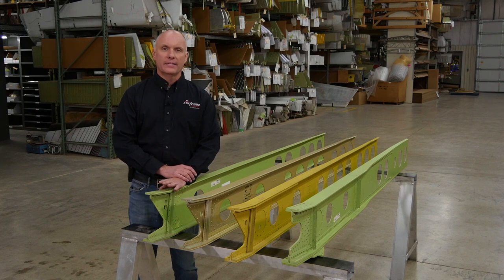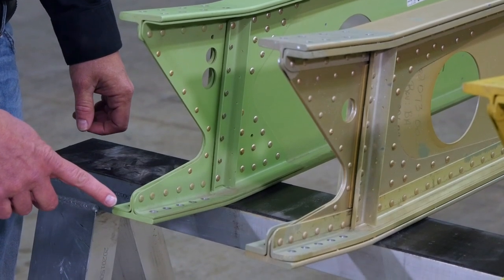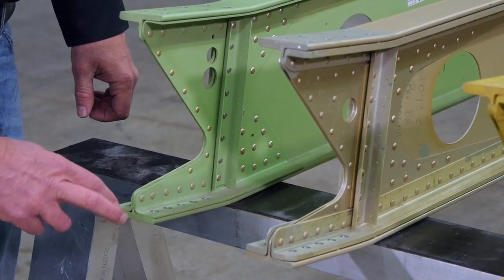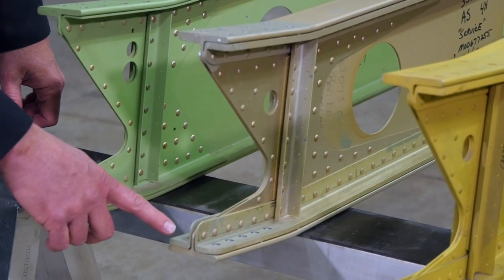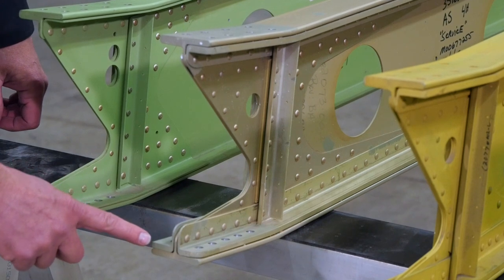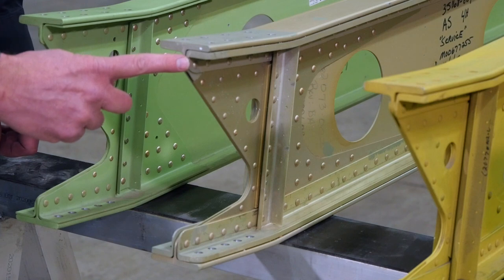The difference is at the outboard end of this spar structure — the grind is different depending on if it's a fat wing or a taper wing spar outboard. The basic PA-28 inboard spar starts with an I-beam segment with a plate at the inboard portion. The PA-28-236 starts with the basic spar and then adds heavier angles on the lower caps and also on the top cap as well.